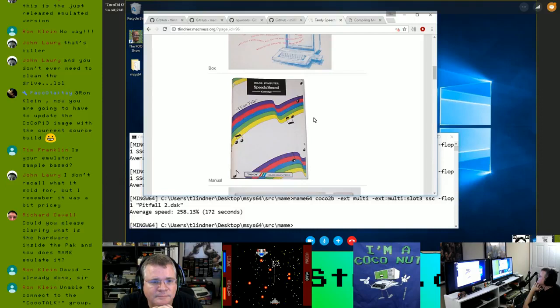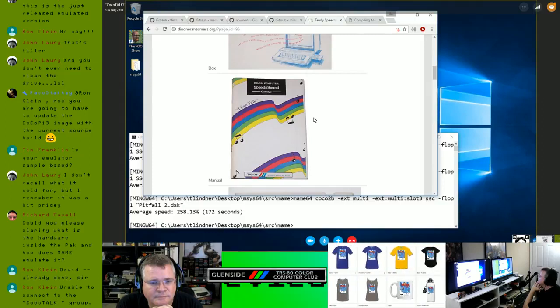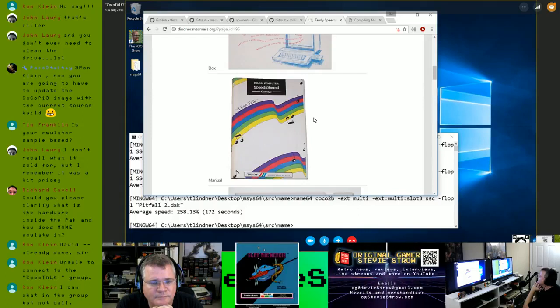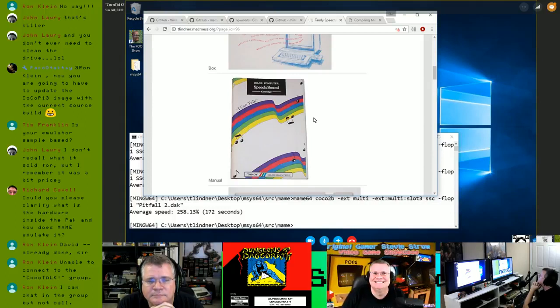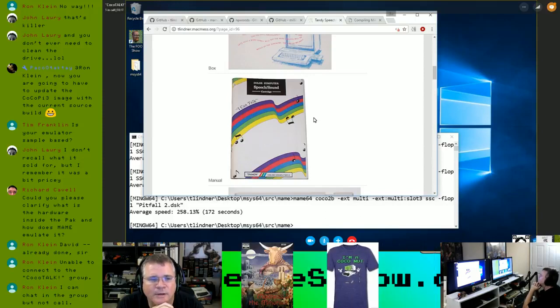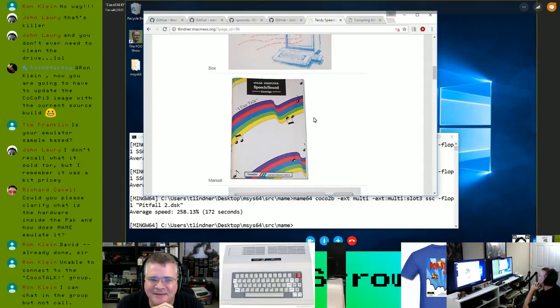And the program that we wrote was run. What it did is copy itself to the 128 bytes of RAM that are available, and then wait for the microcontroller mode to be turned off, which would allow it to see the internal ROM again. When that happened, it started pushing out the ROM 1 bit at a time through one of the data ports on the microcontroller. And that's how we got a copy of the ROM. Wow. Yep. You basically had to siphon the data out of it.